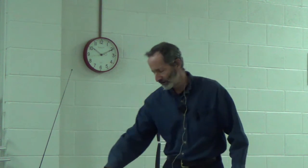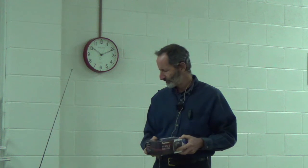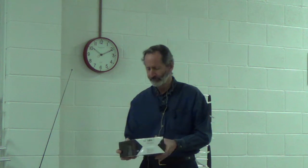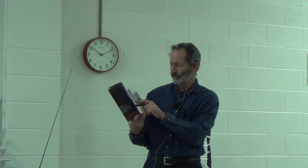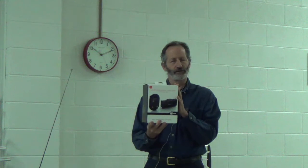As far as amplifiers go, I've been trying a variety of different amplifiers for boosting the signal. I haven't found any one particular amplifier I'd consider the best. I know that if you over-amplify a signal, sometimes you'll actually lose a signal where the TV can't handle it being too strong. My favorite amplifiers for antenna signals are the two-piece amplifiers — part goes on the antenna itself, and the other part goes inside your house. This particular one is designed for two televisions.